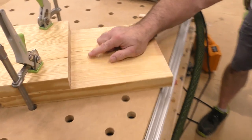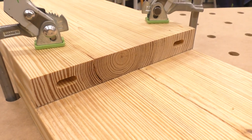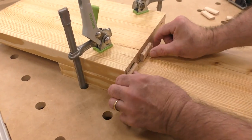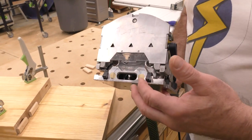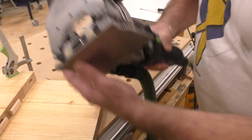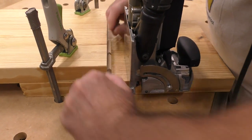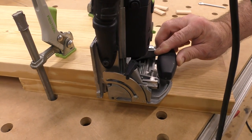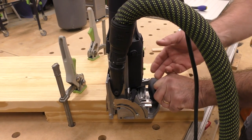Come over here so you can see this — you're going to see how that's daggone close to the center. Now we've got to plunge in here and that's even easier. We just take our two dominoes like that. We're still not doing anything different — we're using these flaps here because the distance from the inside to here is 37. We're just going to plunge vertical. I grab that flap, get my dominoes in there, get them really well balanced — and look, there's my 8 millimeter offset. Plus 10 equals 18. Always remember when you turn on the domino in the vertical position, always pinch it on.